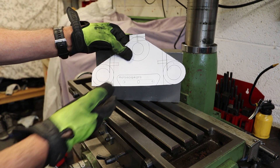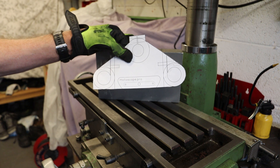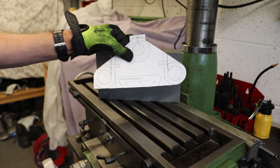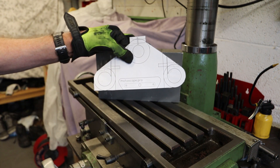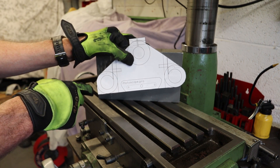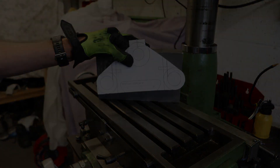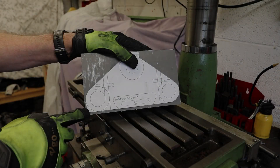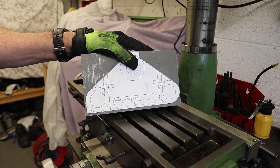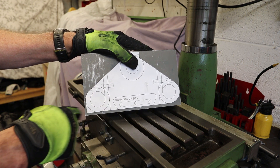On the finished yoke, the front edge — the forward edge on the bike — needs to be flat and square. Of course the left and right corners are rounded as we go around those yoke clamps. For most of the operations I'm going to keep the extreme left hand corner square to enable me to re-establish the reference point whenever I need to make further cuts. Having established that the bottom left hand corner is going to be my reference point, I now need to mill and finish off the bottom surface and the left hand surface.